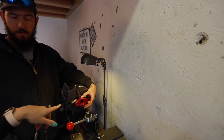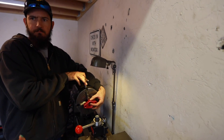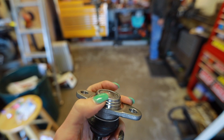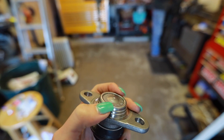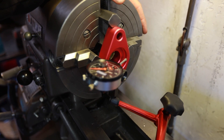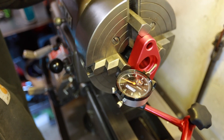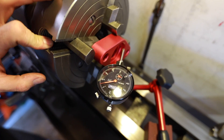How will that spin if it's not balanced? Is it going to be wobbly? No, that'll be fine. Basically what has to happen is — there's three ridges, it goes one, two, three — this top ridge right here is much fatter than the OE Toyota part, so some depth just needs to be added right here. That little gauge is telling you where it's high or low. Right now this side is the low side, that side is the high side. Because I'm measuring the inside diameter it makes me have to think about it. That's pretty close — within a thousandth and a half.